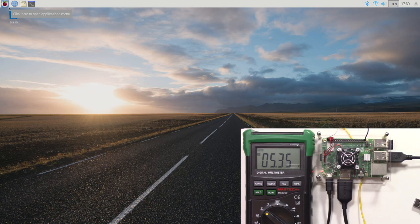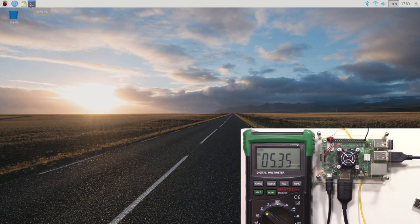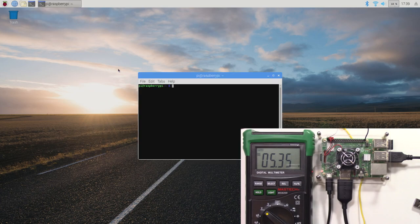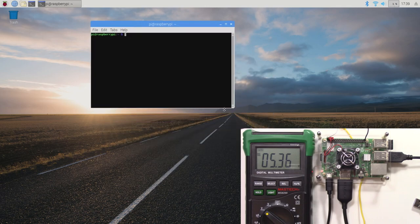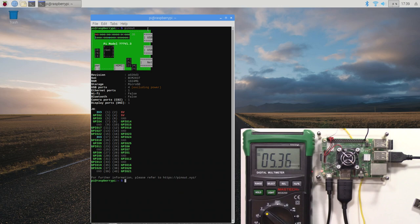Let's start putting a load on it. First I'll show you the pinout command — pretty neat and handy. You saw that GPIO port with all the pins. If you open up your command line terminal and type 'pinout', you'll get a graphic of all the pins. There you have all the pin outs and where they correspond. I'm connected to pin two and pin 39 — ground and five volts — that's how I'm getting the voltage reading off the actual device.